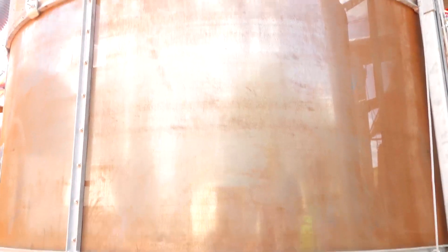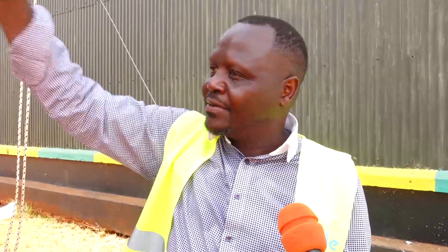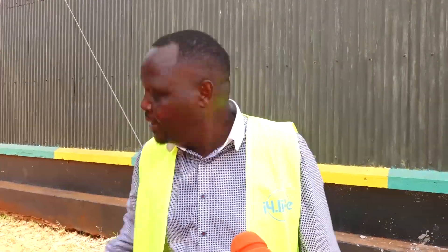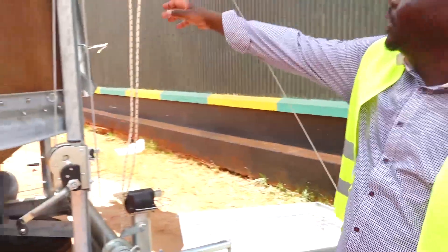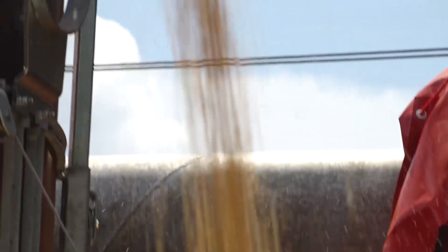At the same time the grain is rotating — it's going up, going down, mixing up all the time. When we turn on the flame, the grain gets hot to the degree that we set, in this case maybe 50 to 60 degrees, depending on the actual moisture content of the maize. Once it's done, it shuts down the burner. The maize continues to rotate for the length of time we set. When it's done, we use this to open that pipe there, and that pipe is where we release the maize from. So the maize comes down here.